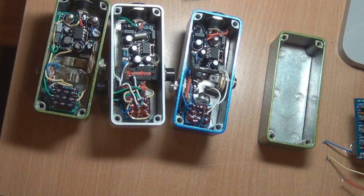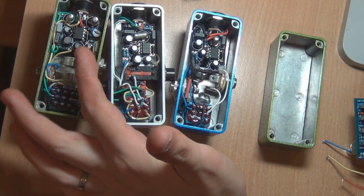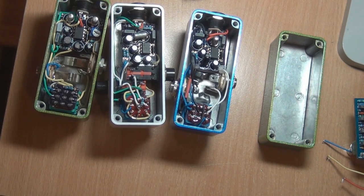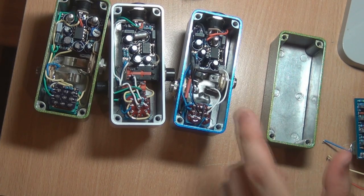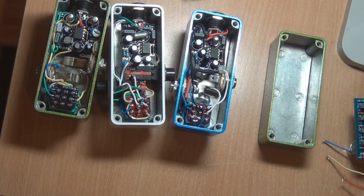So that's some examples of hardware and what to look out for depending on the PCB size. The main point is that the hardware you need vastly depends on the PCB size. The Face Master PCB is small enough to use just normal hardware, but for other boards you need special hardware — you have no other choice. So make sure you have the special hardware, and don't bother trying to fit open-style jacks in — you just won't be able to do it and you'll make a mess of it.